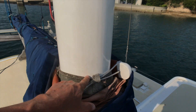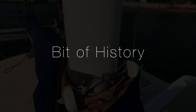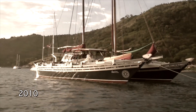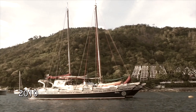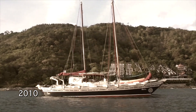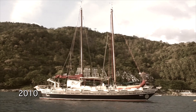It's the second time I've had to do repairs on this mast. It rotted out — the collar of the sail rubbed around the base of the mast. When we originally bought Tiare, she had varnish masts which looked absolutely fantastic. But being in the tropics with high UV, there was just too much maintenance — like once a year we really had to go up there, give them a light sand down and then give them another varnish.